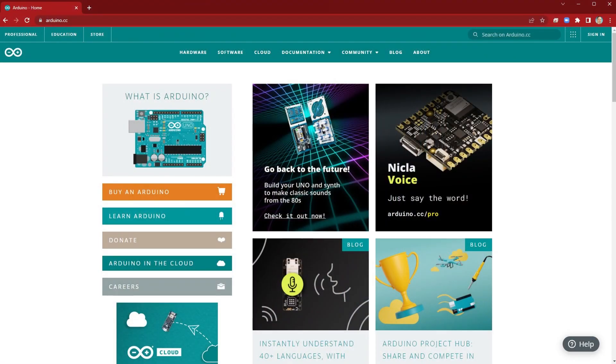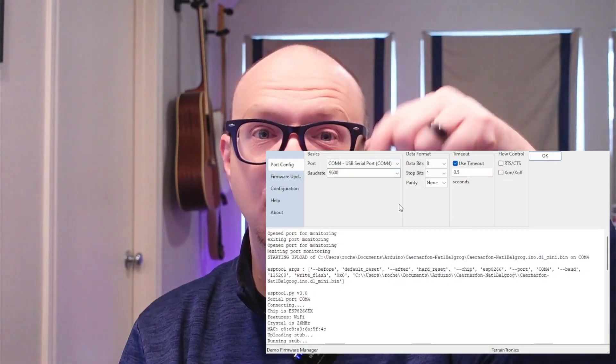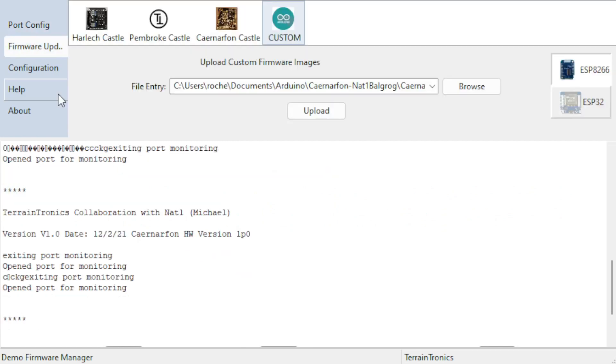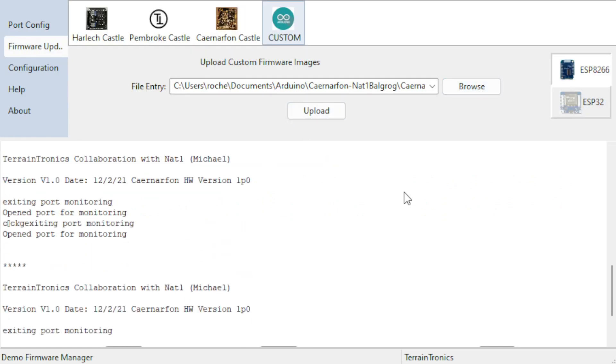For the code, I use the Arduino programming system that can talk to the Wemos D1 Mini through its USB port from Windows, Mac, or Linux. You can find details on how to install drivers for Windows in this video. Once your PC is able to talk to the Wemos D1 Mini, you have options. The easy path is to use the Terrain Tronics download tool, available from the link below — take the pre-made file and download it directly, as shown in this video. That's a really nice and easy way, but you'll be limited in being able to change how the LEDs flicker. For those of you that want to modify the LED patterns yourself, the original code is also available at the link below.